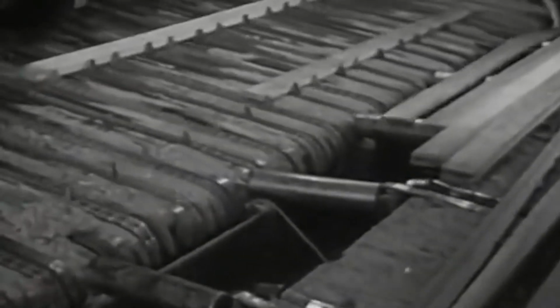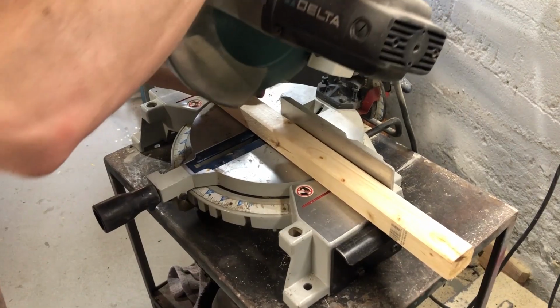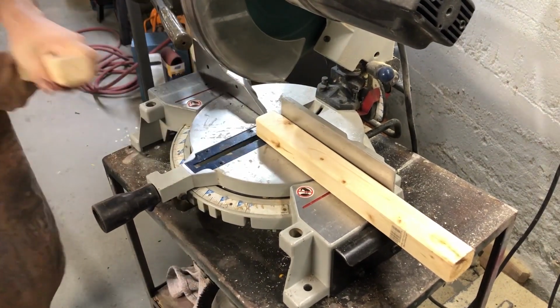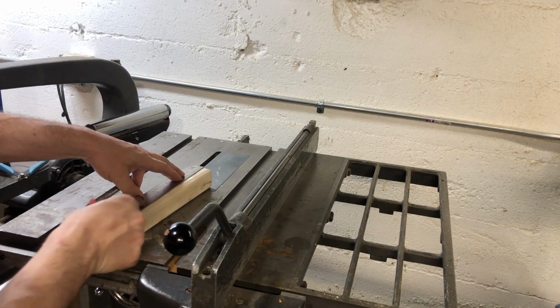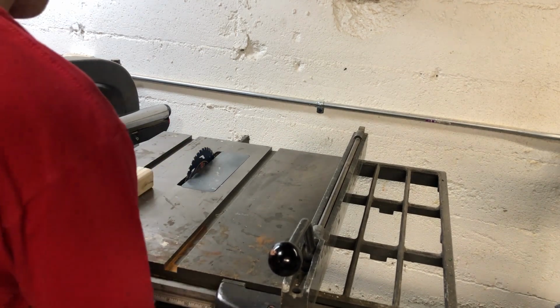I decided to put him on an 8-foot long stake, so I purchased a 2x2 piece of lumber. To make it easier to work with in my cramped little space, I cut off the top 13 inches in order to make the spike. I just penciled in a line from the center top to the bottom corners on each side and then ran those through my table saw.